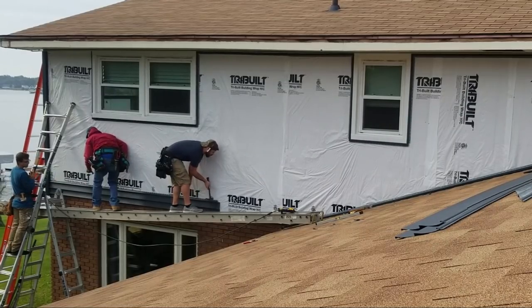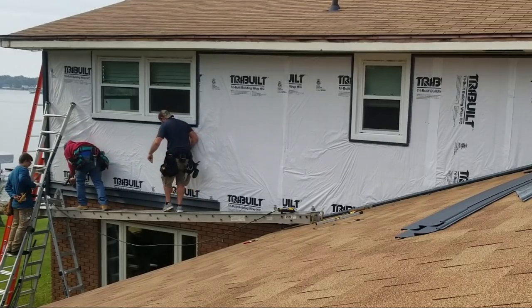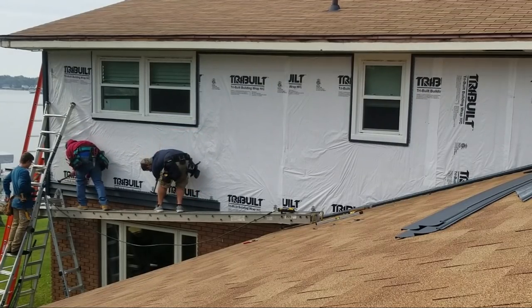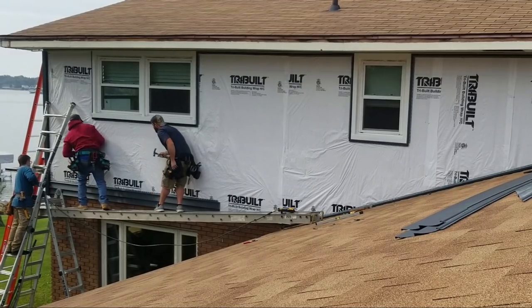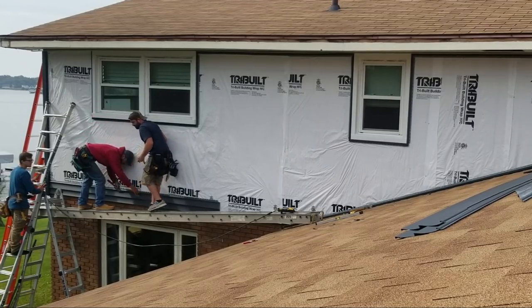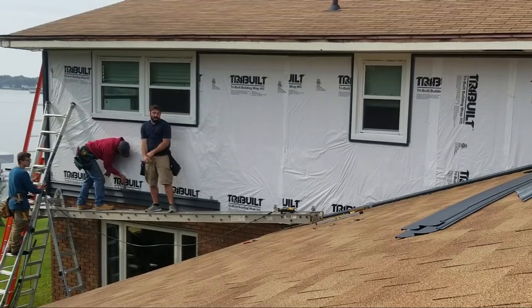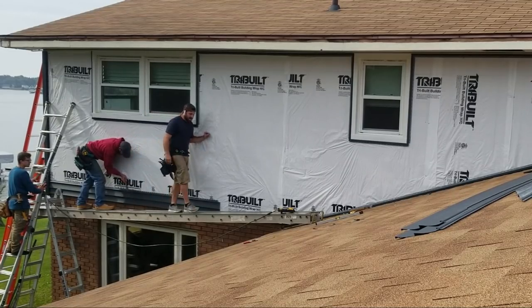Now, when we get to this point, we really hope that the fundamentals play a big part, that we make sure our pieces are locked before we actually drive a nail, because we can do 3 hours of prepping properly and have one whack off, drop the piece of siding, nobody notice, and we get screwed when we get up to a window and have to tear it all down again.